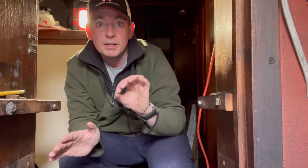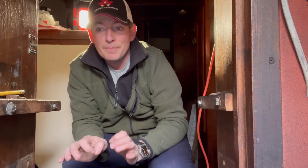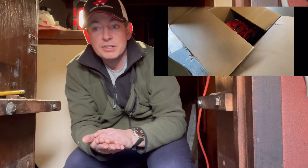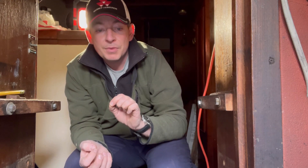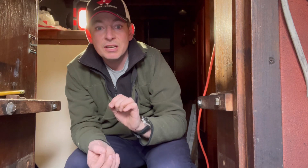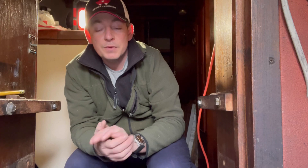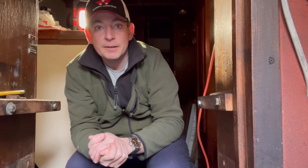We're going to go ahead and get started. We'll clear out the old mounts that were never taken apart here on the bottom of the bay. We'll get those removed and then begin to measure and fit the aluminum plates that the Beta 38 will mount onto. Once those plates are in position and marked, instead of immediately bedding and bolting them down, we'll place the jig just to see how well it aligns in the bay, and then we can go ahead and officially clean, paint, and get them down.